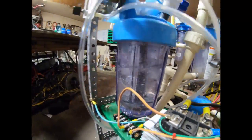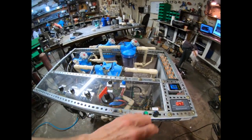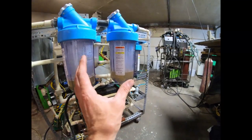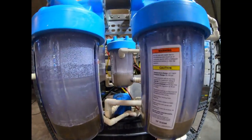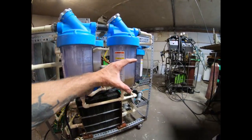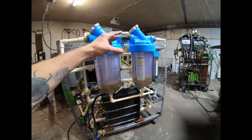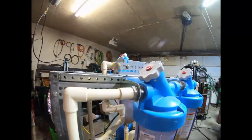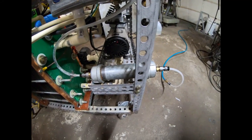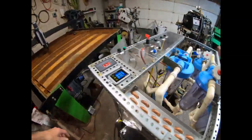Making sure the cooling pump is on. Now these other canisters you see here are for when we're really cranking amperage — foam will build up so bad that it'll start entering the gas discharge line and fall down into this tank to settle. If I were to run it up into the 50-amp area, that foam would even carry over to the next catch tank. There's a third one as well, and I've got a flashback arrestor with stainless steel wool sitting here.